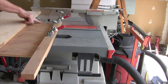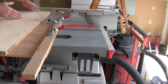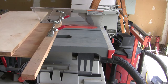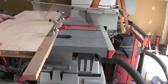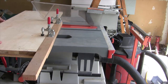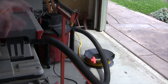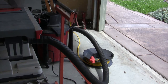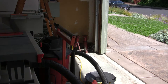We'll cut it this way. The kerf on the saw is about one-eighth of an inch or so. Plus, I said we're going to cut this a little longer — maybe an inch longer just to give us some leeway. I'm going to get this table saw set up and go ahead and cut it. I've also got my shop vac hooked up, so I'll plug the table saw and the shop vac in, turn those on, and cut this. I've also got a roller set up to catch the material so it doesn't fall on the floor after.